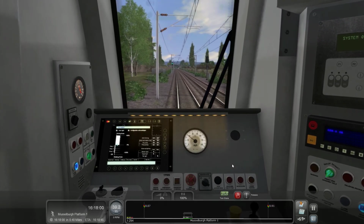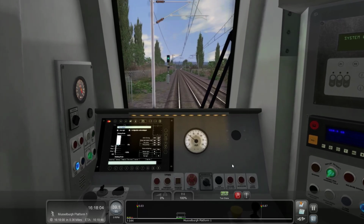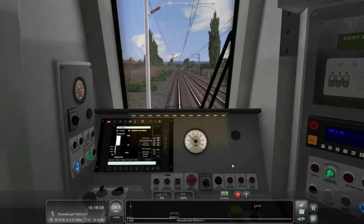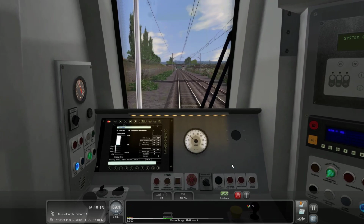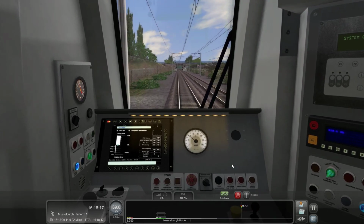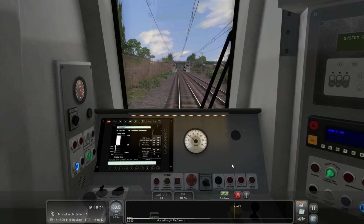So major alarms are safety systems isolated. Unless you've isolated the relevant safety system, you must check which safety system is isolated and apply any restrictions to operation defined in your modular handbook. Brake system fault. The major alarm would normally be initiated by an electrical loss of the brake force, i.e. BCU MCB trip, or a loss of communication of the service brake via the MVB.